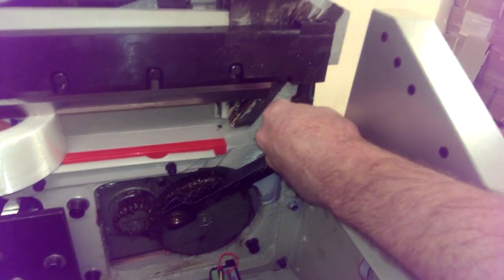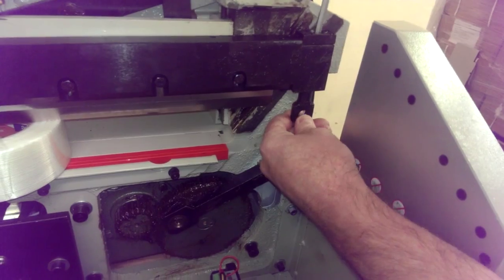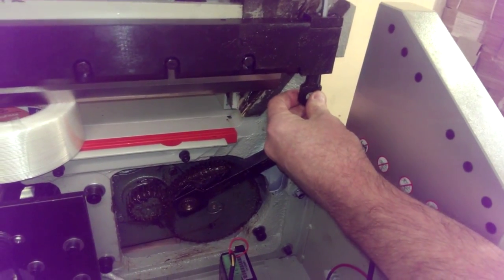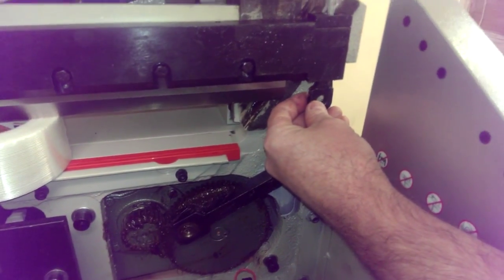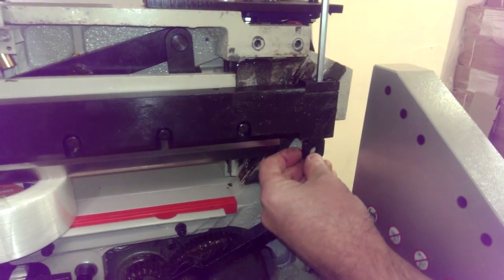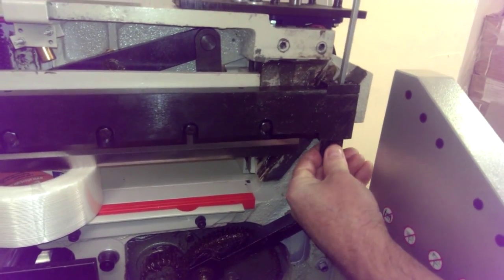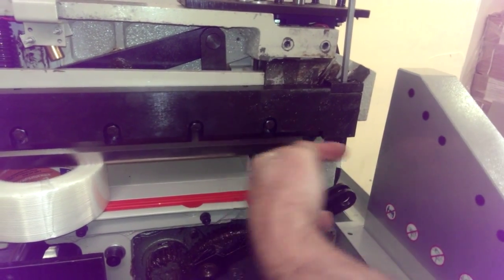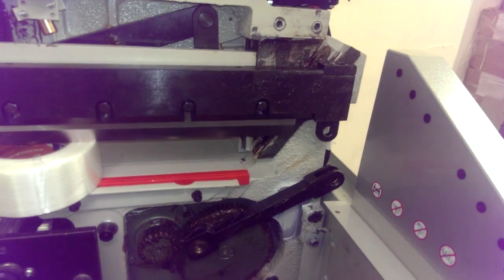Okay, here's my wrench. Here it is. The screw's still up in there, so I'm going to start turning it until it starts feeding up by itself. There it goes. Basically you want to turn it till this is in the full up position, and we'll adjust it later. This is your blade depth adjustment, but put it in the full up position for now. That's the easiest thing to do. Okay, it's pretty much full up. It's got to be perfectly straight this way so you can get in that groove with the 2.5mm.